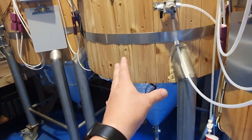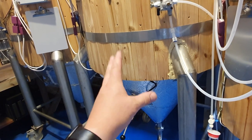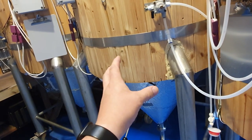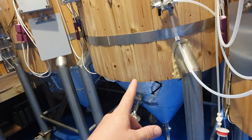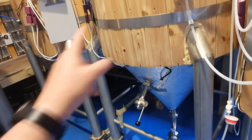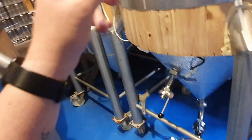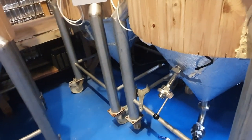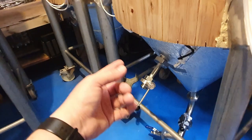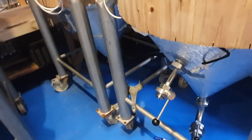We're going to recirculate through the pump, into the spray ball. Then once we've done that, we can attach to the inlet or outlet port and do the same thing there — recirculate the caustic through that. Also making sure that these are cleaned and drained, because they are hidden points for the spray ball to see. Then what we'll do is close that side, drain the caustic out of the tank, open up the rinse water from the bowser or IBC, and burst rinse — five or six bursts of around 30 seconds each, allowing the tank to drain completely in between, to rinse out all the residue of the caustic. We'll do the same through the take-off port.